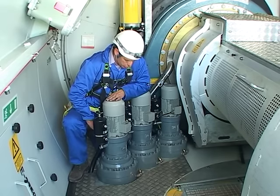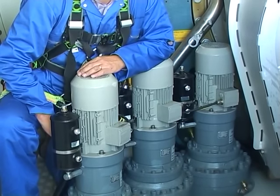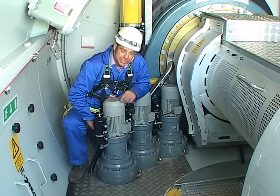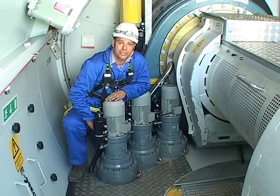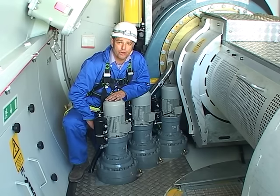The power signals for the yaw are fed to these eight motors around the top of the nacelle. The power is driven through a gearbox and onto a pinion which meshes with a ring gear on top of the tower. This keeps the nacelle pointing into wind, and the nacelle will follow the wind for up to three revolutions, when it will need to untwist its cables and reset itself.